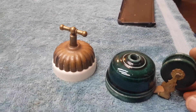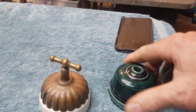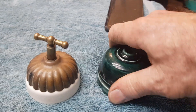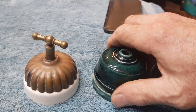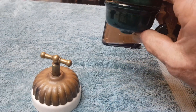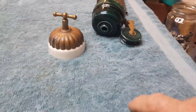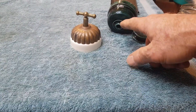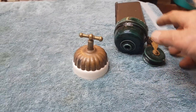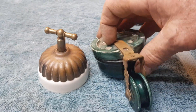The other couple of things I found were in another box — I'm just going to show these because they're really curious items. They're both electrical fittings. This one would have been on the ceiling — it's porcelain with a really nice green glaze. That's where your electrical wiring would connect from inside the house. These would be early 1900s. The wire for the light comes out of the middle, then looped through a weight and back up through a pulley, then down to your actual light fitting — so you could move the light fitting up closer to the ceiling or bring it down. The counterweight was often a nice ornate porcelain item full of lead shot. Nice brass brackets on the pulley with some decoration. You don't see those very often.